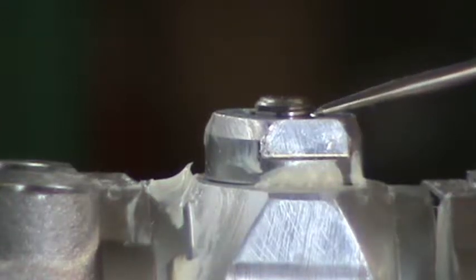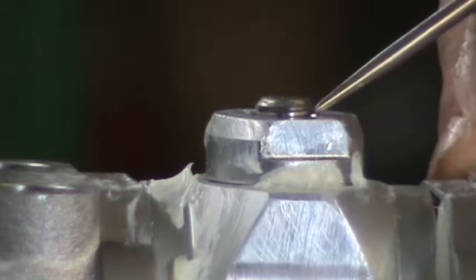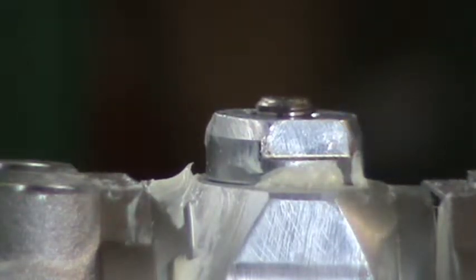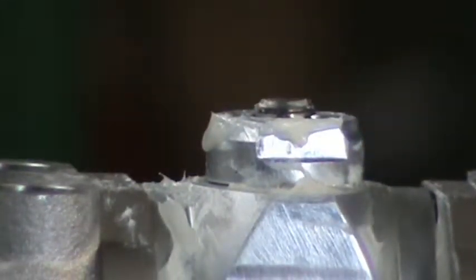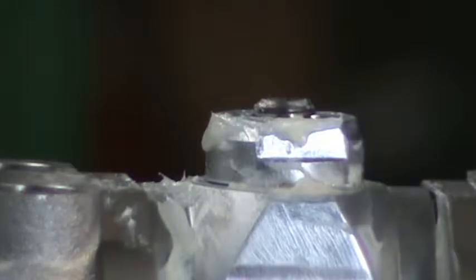Right here. If you do not see that, if it's below the nut, this is why we're taking it apart, because this is below the nut. You're supposed to be Loctited. Sometimes they don't get Loctited. Because there's not enough or there isn't any Loctite, the bolt or that rod slowly migrates down, and that causes the pump to lock in the down position, essentially.